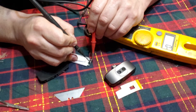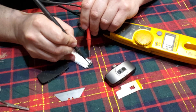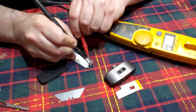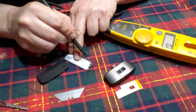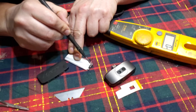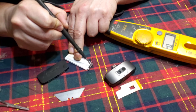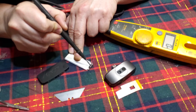Is it on the resistor? There are two little tiny resistors right here and here. Whatever the case may be, it should actually be on this side that we're passing power through. The leads for the battery are connected here and here on this side of the chip, and on this side of this chip. It looks like two tiny resistors. Power goes in on this side, and small switching occurs in here to send power out on this side.